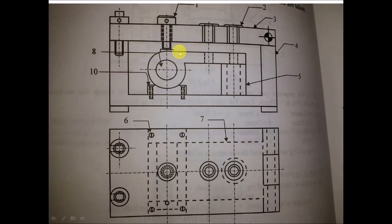Starting with the rough sketch: this is the component, this is the clamping bolt, and these are the 2 drill bushes. This jig is a different type — in the previous example we used a channel jig, but for a complex component we use a leaf type jig. One end is fixed; when you unlock the other portion it opens something like a door — this is the hinged portion. You can mount and unmount the component easily. This portion is called a form locator, and this is the supporting block.